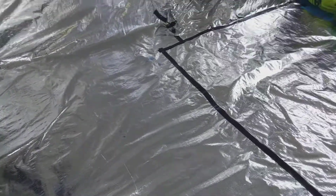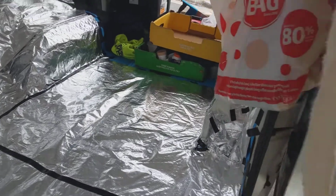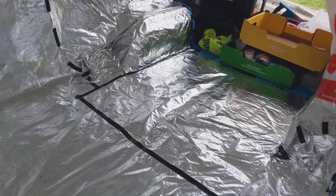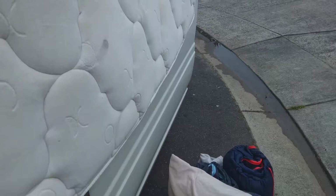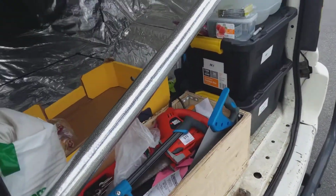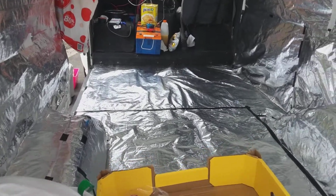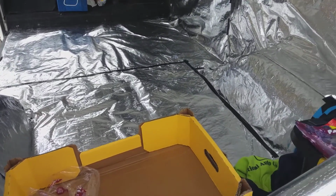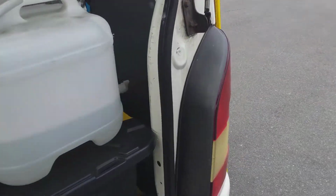Building the floor is the next step now, and what we're going to do is measure out how wide this area needs to be, and plan, and then cut up some timber and plan out the floor structure. Because I want to build a thermal battery as well, I also need to mark out where the holes for the water pipe need to go.